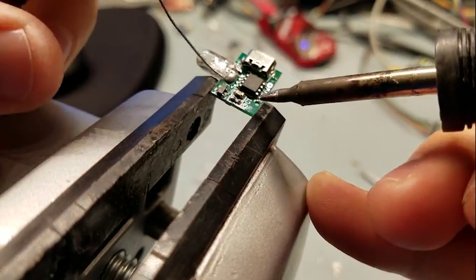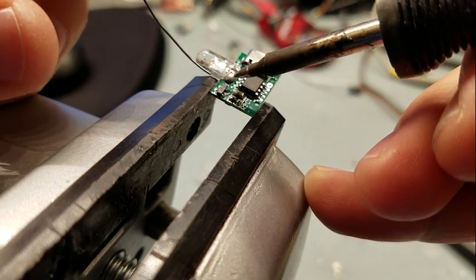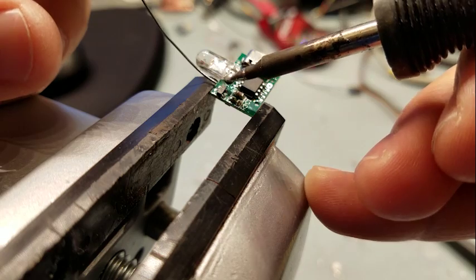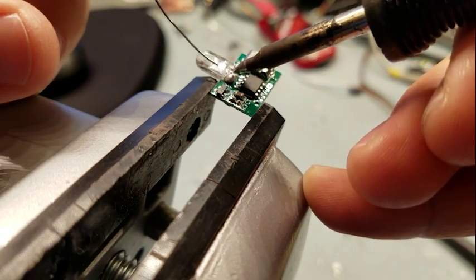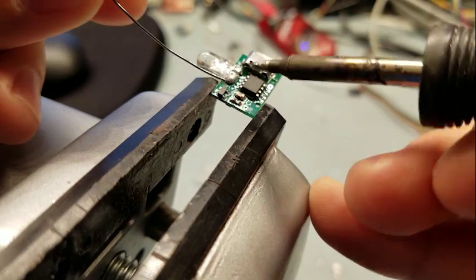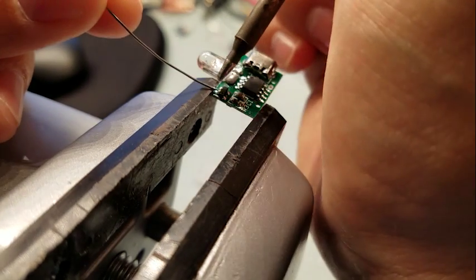It's time to clear all this stuff off. The LED is direct driven through this transistor. You can see there's no resistor in the current path, so we'll address that as well as replacing the transistor with something known. So that's going to come out.